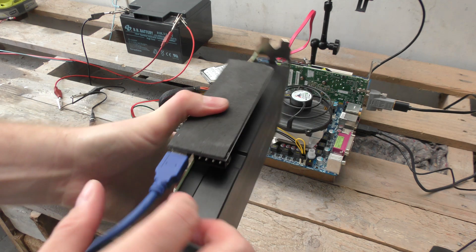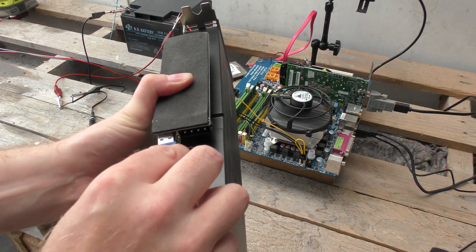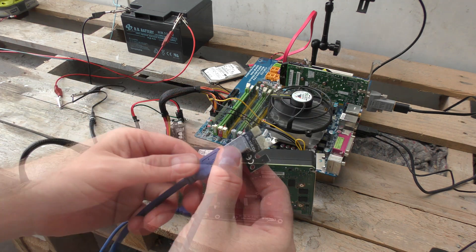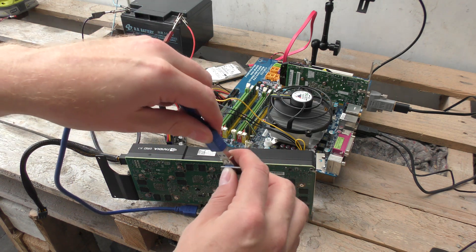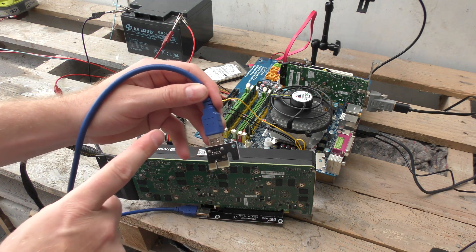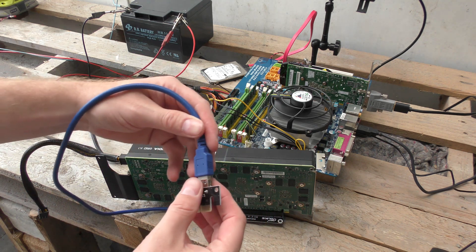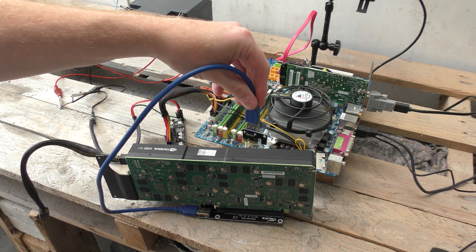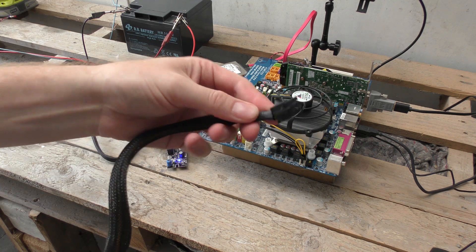To power the riser we use a normal USB connector, but don't plug any USB device in here — it's nothing but a cable. It goes over and converts to a PCIe x1 which you mount on the motherboard, then you use the cable — which just happens to look like USB but is not USB. It's just a cable that is used, and it's nice because it's widely available. But it's really stupid that they used that form factor.